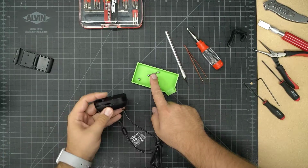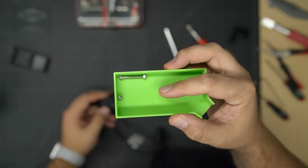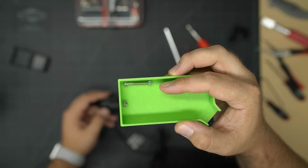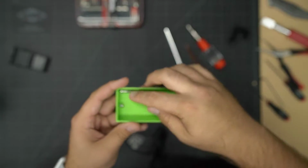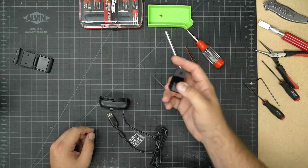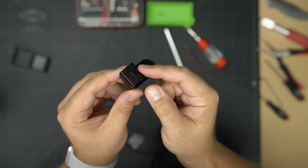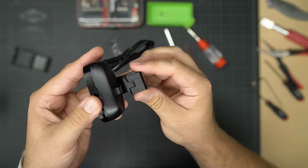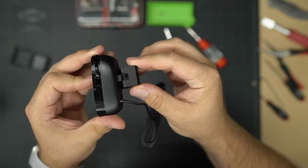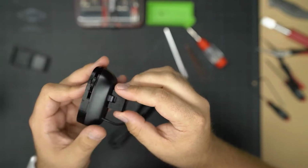And as you can see in here, I have a, let's go focus system. There we go. We have an M3 screw with a nylock. You don't have to use a nylock, I just like nylocks. How this works with the 3D printed part is I designed this little arm, and this little arm has the same knockout as this. You actually want the cables on the left-hand side. So that would go like this. The M3 screw would go this way, and the nylock would go here.